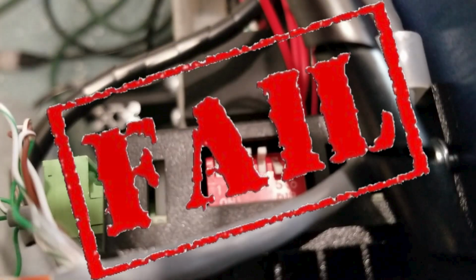Let's clarify for a minute. Limit switches are actual switches that are installed on each end stop of each axis to limit the motion of your production robot, whether it be your X, Y, or Z axis. Dip switches on the drives themselves for your stepper motors or servos usually are allocated for microstepping settings, meaning to adjust the microsteppings of the drives being produced to your motors, or they can also associate them with amperage settings. They usually associate with just simple hardware settings associated with the drive themselves. They are in no way, shape, or form associated with limit switches.